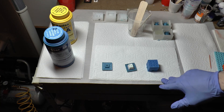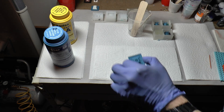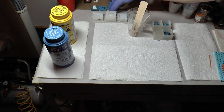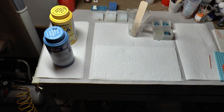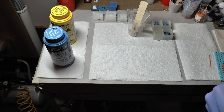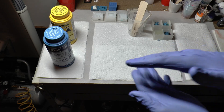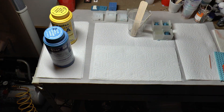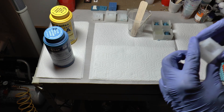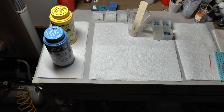That's about it for the Z-BUT system. Now we can talk about mixing the silicone. I've moved on from using Umu 30 to Moldstar 30. Moldstar 30 is great because it's a lot firmer than Umu, which means it's going to have a longer life and there's less chance of the vacuum effect — where you push down on your molds and as soon as it comes back up it forms a little vacuum and bubbles appear inside. You can also use Moldstar 20T, which looks clear and is a little squishier, but I wouldn't recommend that one for the cavity molds — the top of the two-part mold. For everything else it's pretty great.